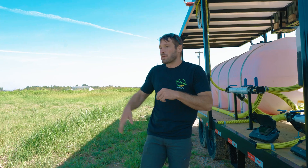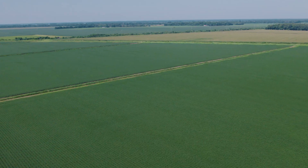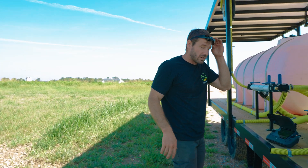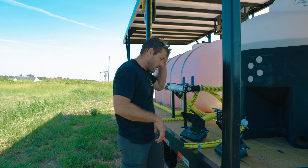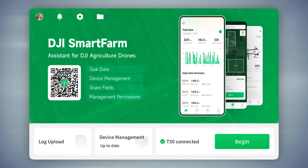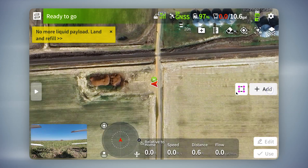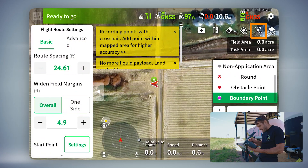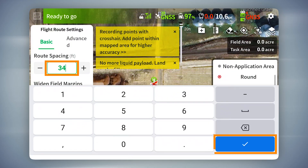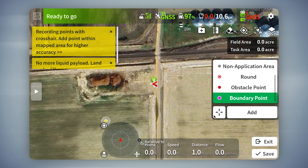This is what we're supposed to be spraying — I mean this is going to be butter. If a guy can't get acres done on this, you ain't going to get acres done. I'm going to take the drone off and I'm just going to mark this little corner off since they don't use it, and then I can boundary the rest without the drone. It's so easy to do this — to build your boundaries, hit begin. I'm going to hit route, hit add, lock that, choose that. Margins is zero, spacing is 34. Got that done.